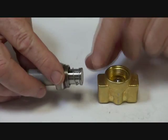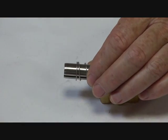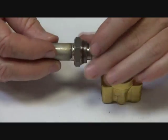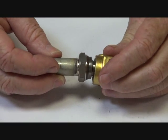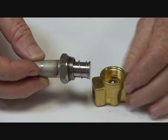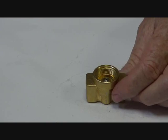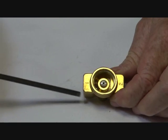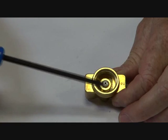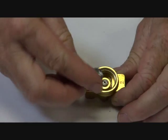We have the armature inside here, which has a PTFE seat for the high pressure and a spring to assist it to close. The armature is sitting on top of the valve like this. When the coil is energized, it pulls the armature off the seat, which allows the product to flow. The product media comes through here and sits around the armature assembly, assisting it to close with the spring.